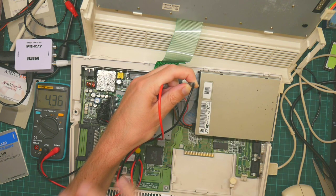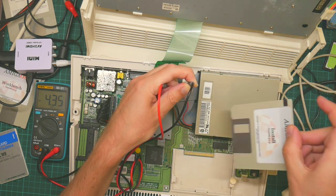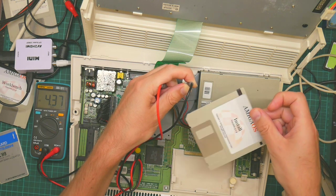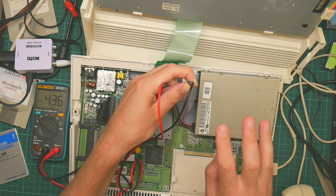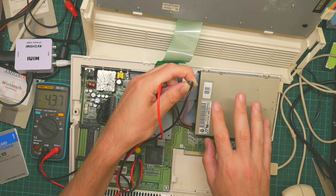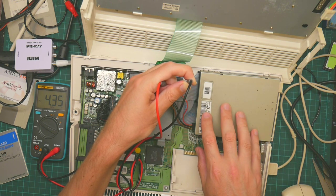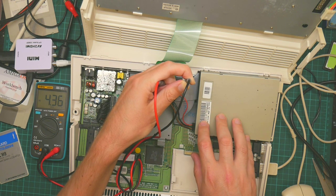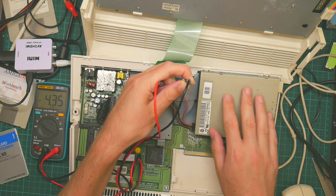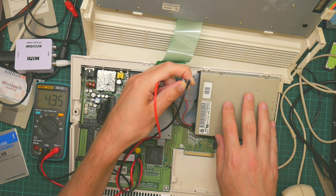At the best of times it's still rather low, so it doesn't always work. And it may also explain why these high density disks aren't working in this drive, because floppy disk drives are very sensitive to the input voltage. I've got one that works at 5 volts and does not work at 4.6 volts. And this is lower than that — so if the head amplifiers aren't doing their job properly at this voltage, this may explain why it's all a bit weird.